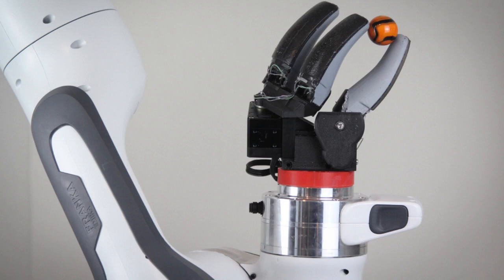Optical tactile finger sensors allow robots to use inexpensive cameras to collect high-resolution images of surface contact, and by observing the deformation of a flexible surface, the robot estimates the contact shape and forces applied. This work represents an advancement on the GelSight finger design, with improvements in full finger coverage and the ability to approximate bending deflection torques using image differences and machine learning. Improving a robot's sense of touch to approach human ability is a necessity and perhaps the catalyst problem for developing robots capable of working on complex dexterous tasks.